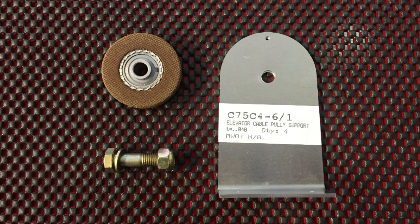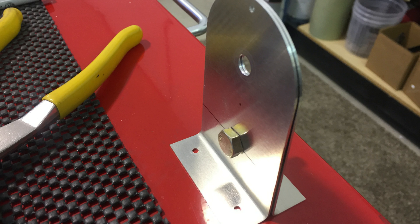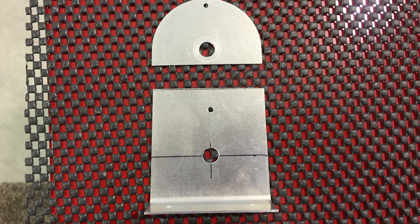First I want to talk about this pulley that I riveted under the top skin for the cable. These are the three parts I got from Zenith — just another one of their elevator cable pulleys with a bracket. I wanted mine shorter than the stock brackets, so I drilled new holes in there for the bolt. After that, I sliced off the top of each bracket after drilling the little hole where the cotter pin will go to help hold the cable to the pulley.